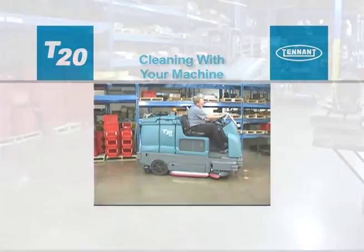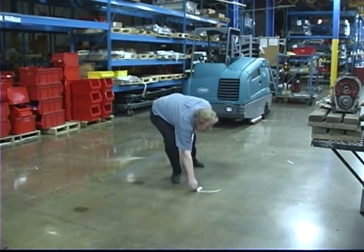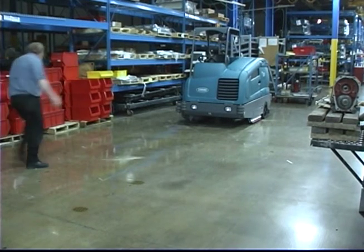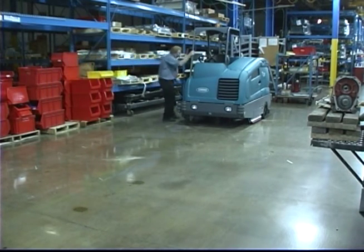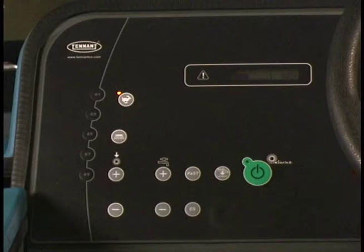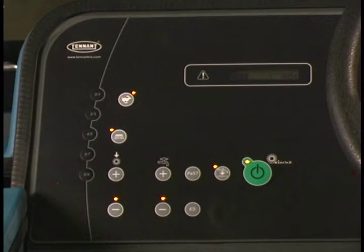Cleaning with your machine. Before scrubbing, manually pick up oversized debris, wire, string, twine, or any other debris that could become wrapped around or tangled in the brushes. Plan scrubbing and/or sweeping in advance and try to arrange long runs with minimum stopping and starting. To start scrubbing, start the machine and if necessary, set the scrub mode and settings for the area being cleaned. Press the one step scrub button to start scrubbing. The light on the button turns on and the machine defaults to previously used settings. Note: do not turn on the fast system during conventional scrubbing. Conventional cleaning detergents could damage the fast injector system. If fast operation is desired, drain, rinse, and refill the solution tank with cool, clean water before operating the fast system.